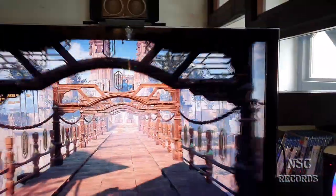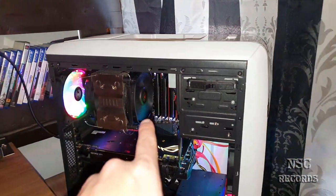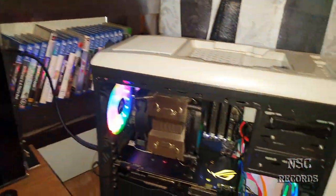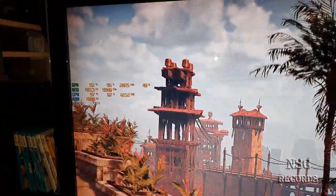Pause. Oh my god, guys, I'm testing some stuff on Horizon. You're never going to believe me, but it's all back, like you can see. I was able to set the fan speed a little bit lower and I have better temperatures. Yesterday I was at 4.2 gigahertz and the CPU was running at 77 degrees maximum, okay? Now I'm at a maximum of 58. I'm still waiting, because I want to test it till the end. But wow, these are already more than 10 degrees better temperatures.